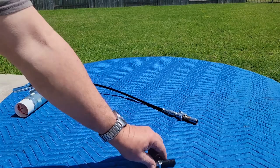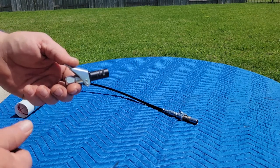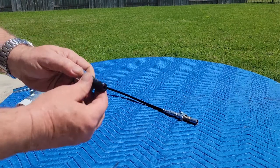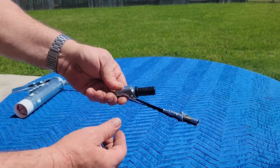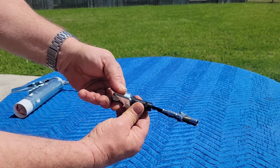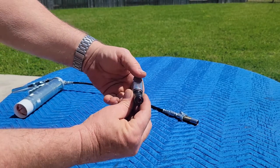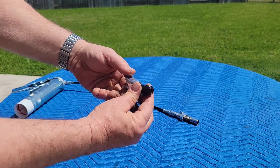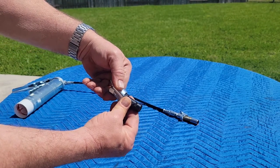I got a hold of Lube Shuttle and found the problem. Their website says they're available 24/7 — I left a message and they called me back within about five minutes. The problem: if you put the coupler on a funny angle and pull the hammer back, this piece here can actually twist, and when it's twisted it won't let the hammer go forward. It's flat on each side so it has to go all the way forward on those flat sides to engage. At some point it got a little twisted and even a little twist means it won't fire.